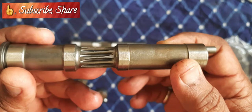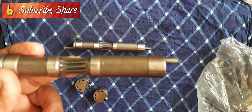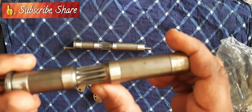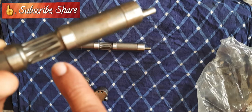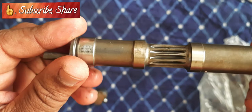There are two possibilities when you install a worm nut and when you replace your disc. I always suggest buyers to replace the worm nut and also, if possible, replace the spindle, because the problem is the spindle has eaten up. If you can see the spindle grooves — the worm grooves have been eaten up on one side.